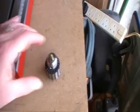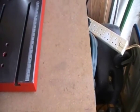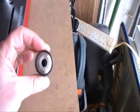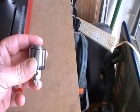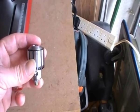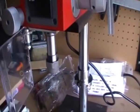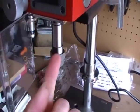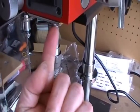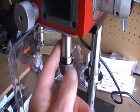Back to this. It does come supplied with a keyed chuck that takes up to six millimetre. But it's not advisable to mill using a chuck — simple reason being it's only held on by a taper, and the lateral movement on it can loosen it and then it will fly off. So I bought a collet holder for it, which is that. It's also held on by a taper but you've got a socket-head bolt that bolts up into the quill to keep it all nice and tight on there.